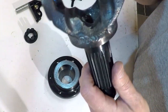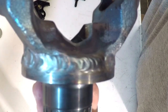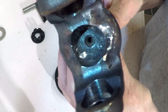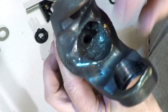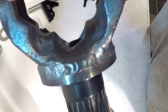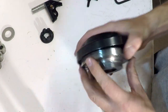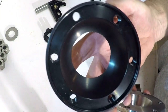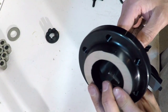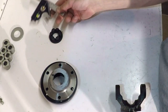Here's my finished — I'm going to call it a yoke. I TIG welded around the perimeter because I'll get the most strength out of it that way. I did shoot some MIG on the inside — I would have liked to TIG in there but I couldn't get in; it's kind of like a little hole. With the MIG I was able to just run a circle in there to get a little extra penetration, but I'm expecting most of my strength to come from the outside weld. It came out really nice and it netted me two inches — the drive shaft can now become two inches longer, which is fantastic.